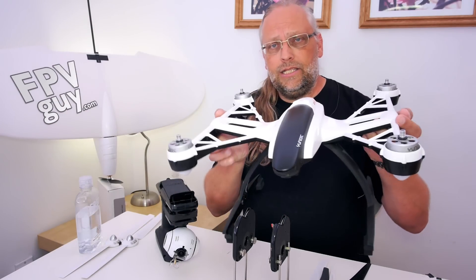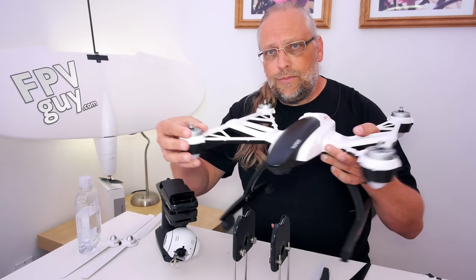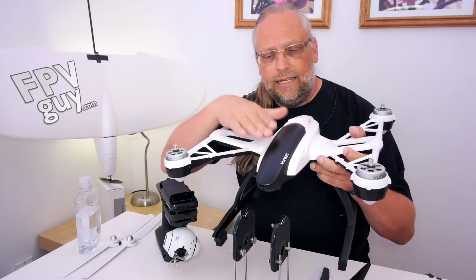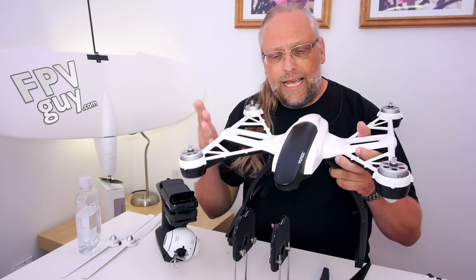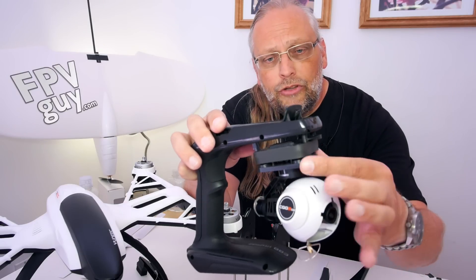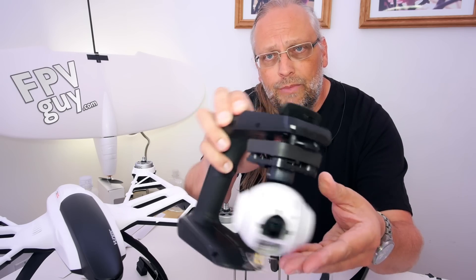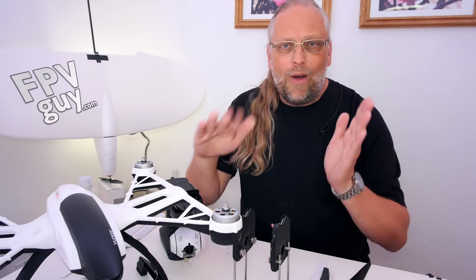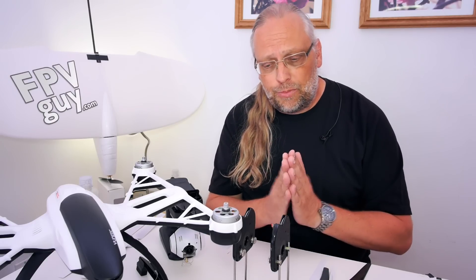If you take a multi-copter like this and there's a propeller like an unbalanced wheel — you know how an unbalanced wheel will make your steering wheel shake — if there's a propeller pulling back and forth because it's unbalanced it's going to make the aircraft shake. Inside is a little IMU, which is a motion sensor, and if it's being shaken like that it's not gonna be able to do a really good job at keeping your aircraft stable. Equally important, the camera is mounted with a little bit of give that kills vibrations, but if there's too much vibration you're gonna end up with the camera vibrating and that gives you jello — those wavy vertical lines in your picture. So we're gonna look at two ways you can balance your propellers today.